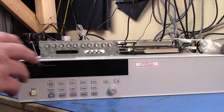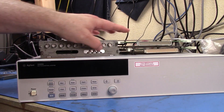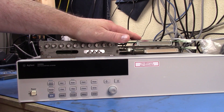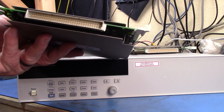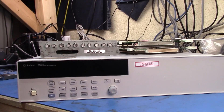What they enable you to do is run a variety of these cards that I have, I'm showing here. These cards let you do various things. For example, this card over here - an N2263A - is a 32-bit digital I/O board, which enables you to set a channel and put out a 32-bit one or zero value out to separate lines. I think it goes up to 42 volts, but not a lot of use for that.